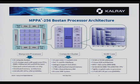Then of those compute clusters, we put 16 on the many-core processor. In addition to those 16 compute clusters, each of them having 16 cores plus one management core, we have two blocks of I/O clusters. Those I/O clusters are connected to a DDR controller, Ethernet, and PCIe, and they are powered by two quad cores. Those quad cores implement exactly the same architecture as all the compute cluster cores, because we figured it's complex enough to have a multi-core or many-core, so let's try to have a single ISA for the whole programming.